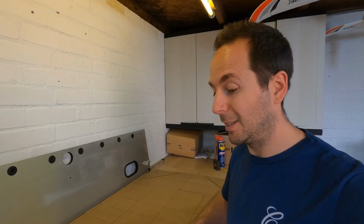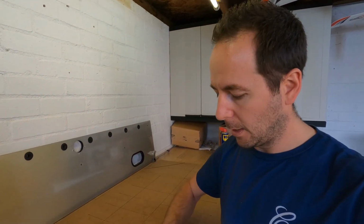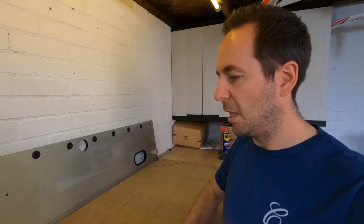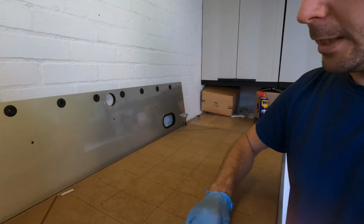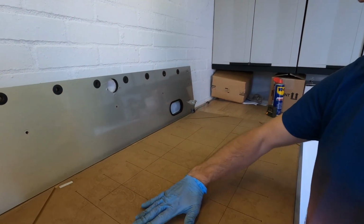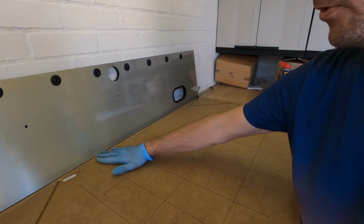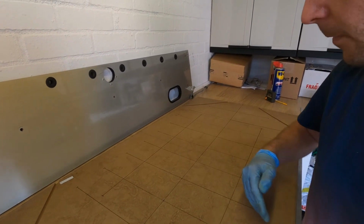Mark up the back of this surface. Because we couldn't get this to stay flat with the weight on it overnight, what we're going to do is what we call kerfing cuts, which are not going all the way through, just a couple of mil into this. So this is 9mm thick MDF. We're going to go maybe 3 or 4mm deep on all these black lines here. The idea being it'll allow the wood to form the shape I want it to form, and I'm going to bond some stringers on the back that are going to pull it to the shape I want.